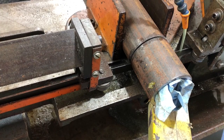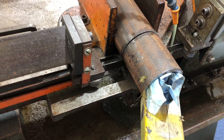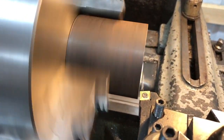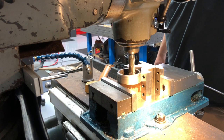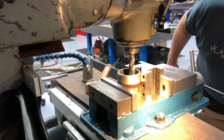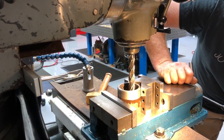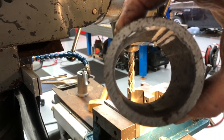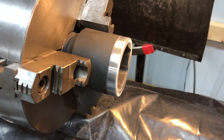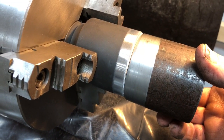I got to hack a piece of that off. Look at that square — I got that saw cutting great. That piece right out of the saw, the burr's still hanging off it. I carved that bugger right out of there. Since this is a socket it's very hard, so I just used my flap wheel and a grinder — as the part turned it took that black coating off so now I can weld that on dead center.